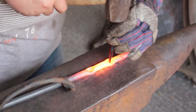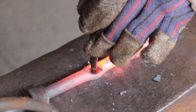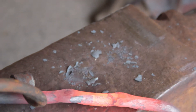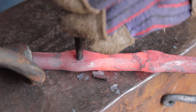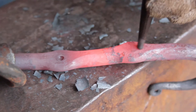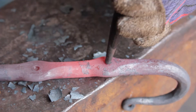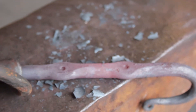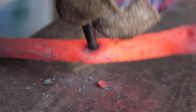During the ball punch process, I keep it straight and square, and then I use a hot punch and make a hole in the middle of each of the ball details. I use a punch that's about four millimetres on the end. The holes are for fitting the bracket up later — that's where the screws go through. The little piece that comes out of the hole is called a slug.